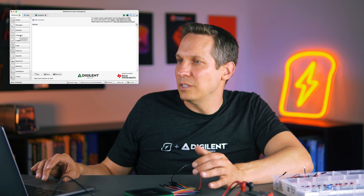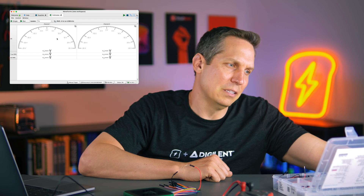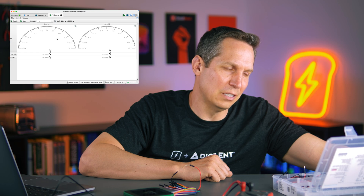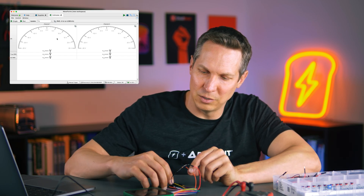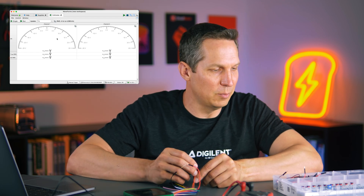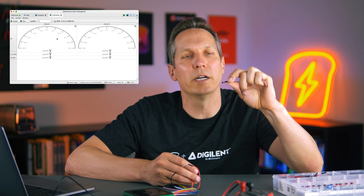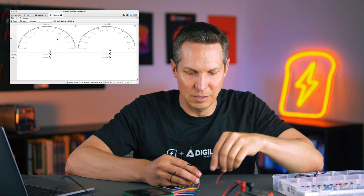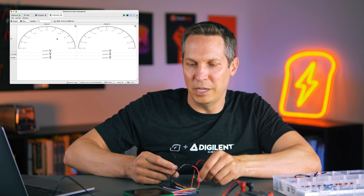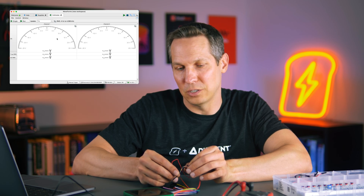So we go back to the welcome screen and click on voltmeter, and it shows channel one and channel two. I look at my reference again and I want analog input one positive and analog input one negative — that's the orangish and the orange and white stripe. I can find those; they're near the top and that is one plus and one minus. Since they are female connectors, I'll grab one of these wire leads and stick the black one into the negative and put the red one into the positive. Then I can just manually touch them to the leads.